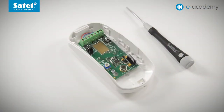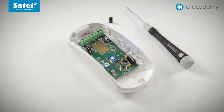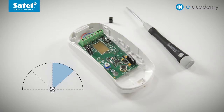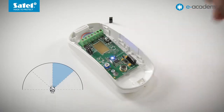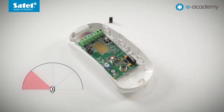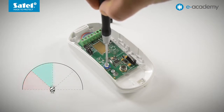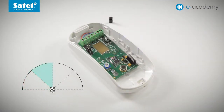To enter the LED color selection mode for alarm or trouble indication, remove the jumper from the LED pins within 10 seconds of the detector power up. The LED is now flashing the color indicated by the PIR potentiometer. This color does not have to be the same as the one used up to now to signal alarm or trouble. The potentiometer setting closest to the leftmost position corresponds to the first color, which is red. If I turn the potentiometer slightly to the right, the detector starts flashing the second available color, which is a shade of green.